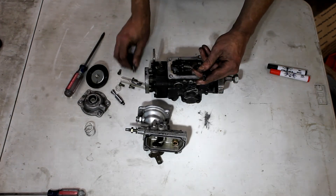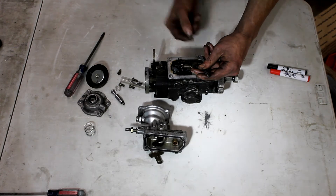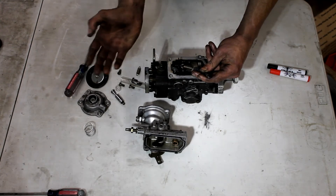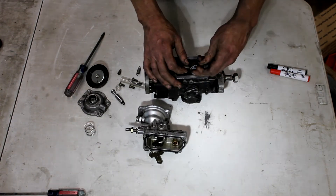The 366 is a much stiffer spring but the same length as the OEM 388, so you can just drop it right in and it gives you a 3,200 RPM governor. You can manipulate the springs by pulling on them harder - we went over that in the other video. Be sure if you do that you say, 'I am fully responsible if I screw my pump up,' because you can do it very easily.